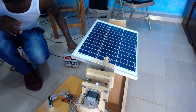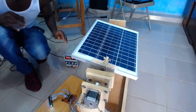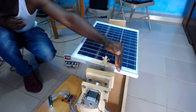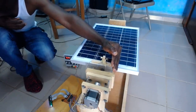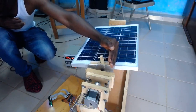Let me do a little demonstration so you can understand how the system works. Let me try to block light on this side and see how the panel recalibrates itself. You see — when I block or put something in the way of that light-dependent resistor, the panel changes and tries to recalibrate itself to make sure there is balanced light intensity on both sides.